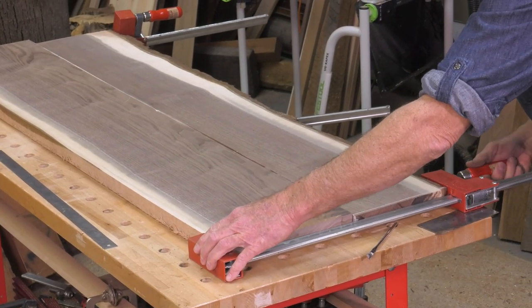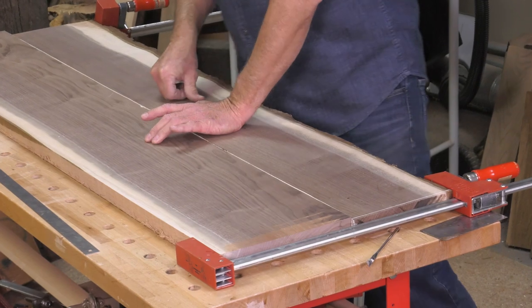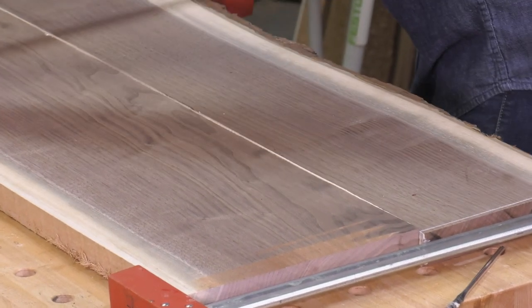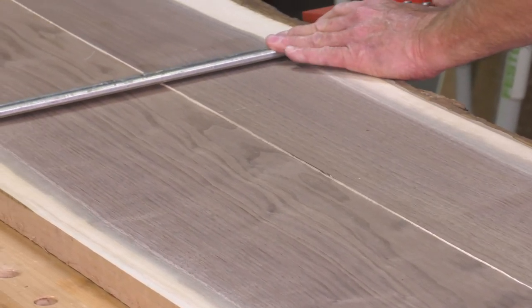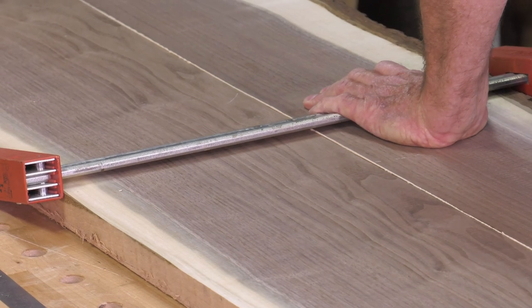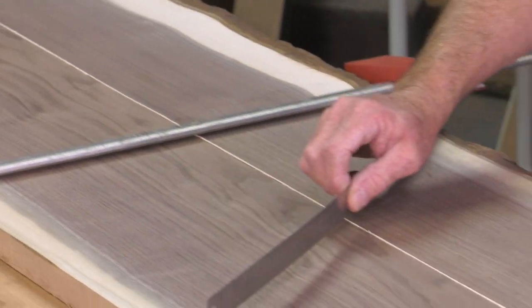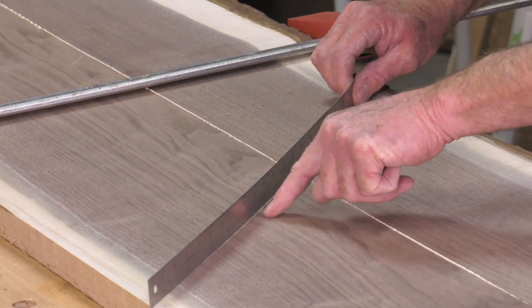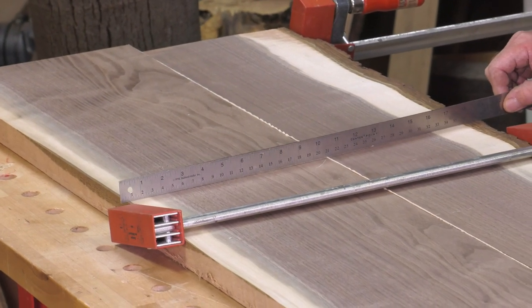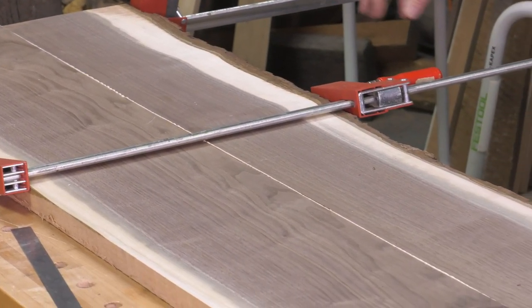And I'll show you the quick trick. Oh yeah, look at that squeeze out, that's perfect. And this needs to be pressed down because it's sprung up a bit. Boards aren't perfect. So you have to learn how to read the board and work with it. Pressing down. Okay, and look at that perfect squeezed out bead. Now, take a straight edge and lay it across there. I've got just a hair of daylight there and a hair down there, but that's nice and straight there and tight. So let that cure out for 2 hours and then we can work with that.